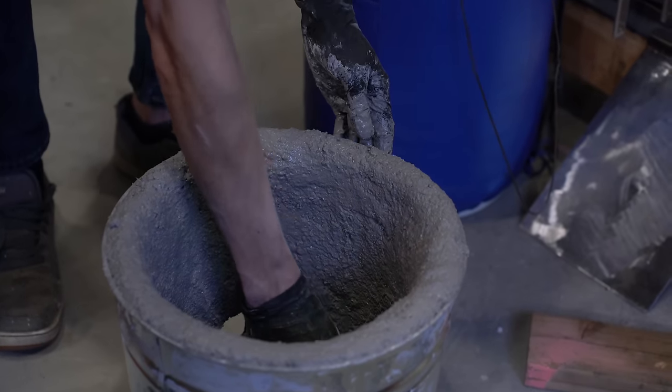We've got everything coated and I think it went really well. I'm going to give it about 24 hours to just dry on its own. Then I'm going to slowly start heating it up — I'll get the burners attached to some propane. Start with just one burner with the gas as low as it goes just to get warm, and slowly increase the heat over the course of several hours until I get the whole thing up to a nice glowing orange. That should get it to where it's ready to actually be used.